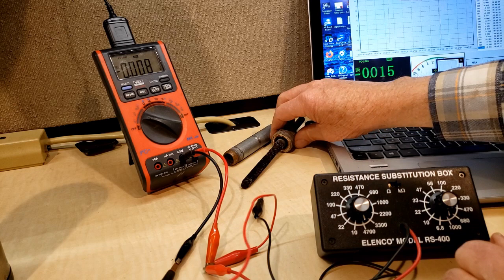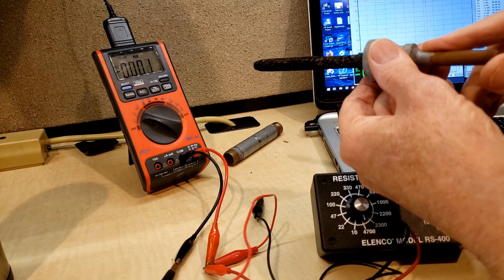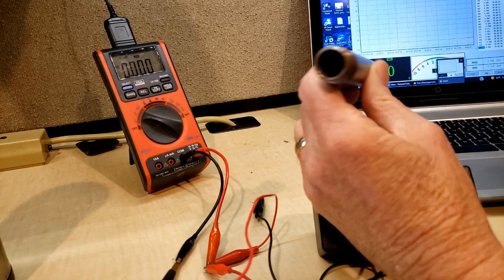The working electrode for this test is a 1/8 inch by 4 inch iron pipe that has been co-deposited with palladium. It's screwed into a coupling here, which is connected to this pipe here, which is epoxied into the back of this fitting so that it has electrical isolation between the fitting and the working electrode. The counter electrode is a pipe. You can see it's empty.